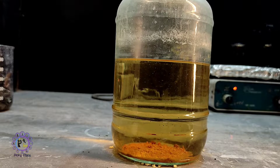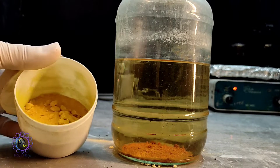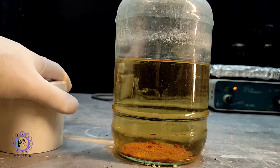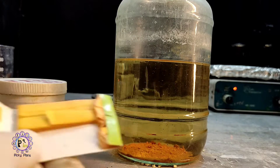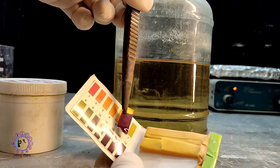Finally, this is how I disposed of the cyanide waste. I already added some aluminum polychloride to remove any contaminations like heavy metals and get a clean solution. I need the pH of the solution to be around 11 so I can destroy the cyanide using bleach.